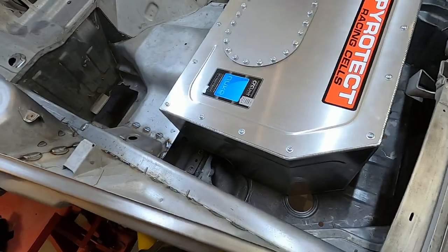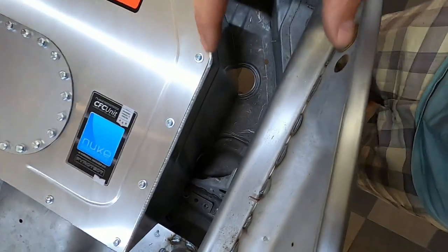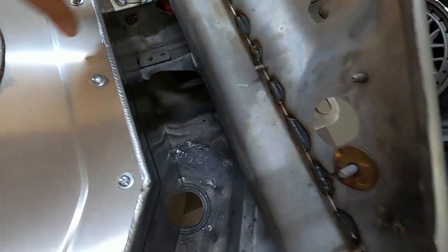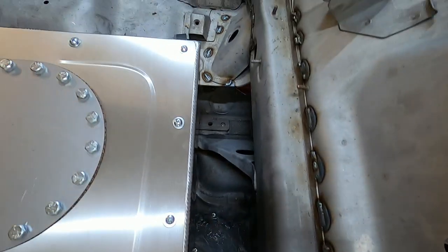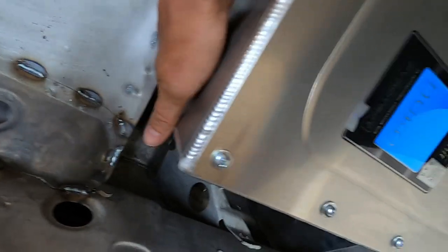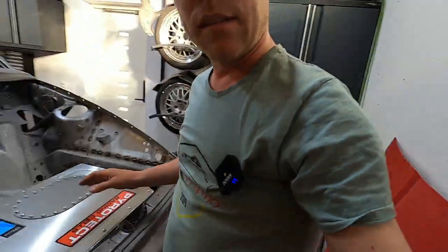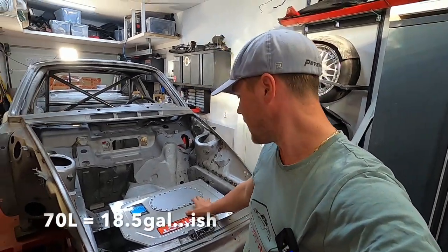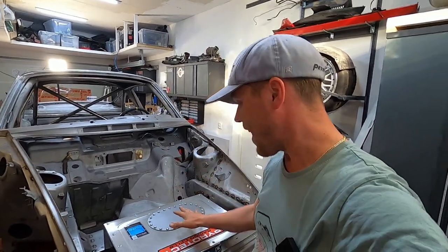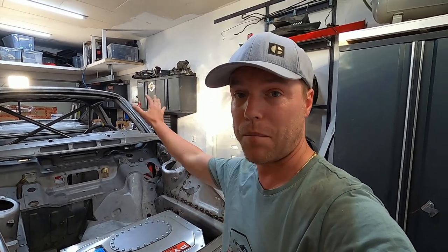What I've done here is create a fuel tank that has an air gap and follows the geometry of the car perfectly. That air gap is about 10 centimeters — it's a safety barrier. On this side I've recessed it so it doesn't interfere with the steering mounts or stiffening for the steering. This tank is about 70 liters and it sits nicely there, moving the weight forward and down, helping the weight distribution of these cars, which naturally is very heavy towards the back.